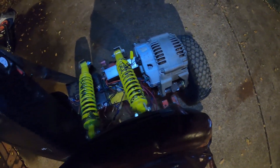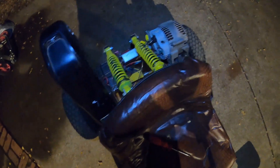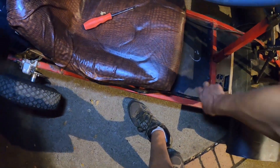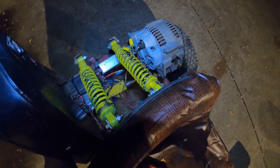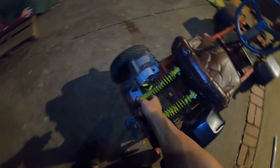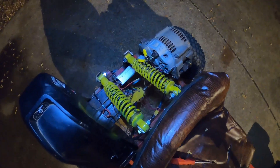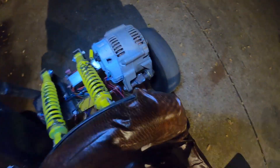You need 12 volts on the electromagnet brushes — otherwise this is what happens: without 12 volts it jerks and makes a weird noise and won't run consistently. Once you connect 12 volts, it runs smoothly. So no matter what, you need that 12 volts or it won't work. For reverse, all you do is connect the two reverse wires on the controller and it spins in reverse — though it does spin a lot slower in reverse.